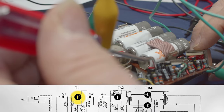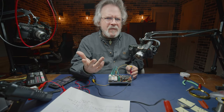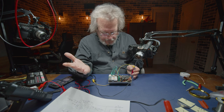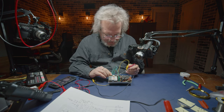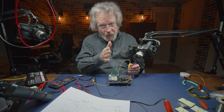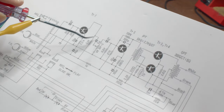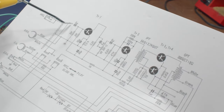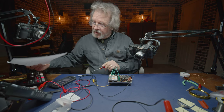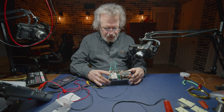Right after the input amplifier there's signal, so something is going on. The first assumption would be the transistor's blown - I'm injecting into the amplifier and nothing's coming out to the next stage, because that capacitor couples the first stage to the second. Where I'm actually hearing tone is on this capacitor, which is basically the input to the volume control. There's tone there but not here, and what's in the middle is an active component called a transistor. Let's take a closer look.